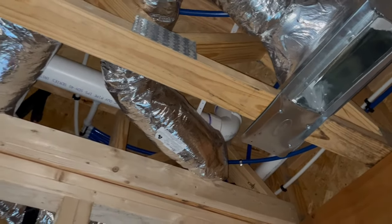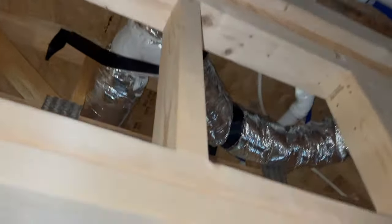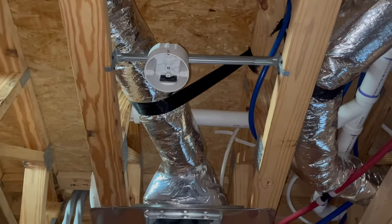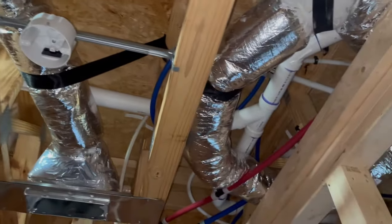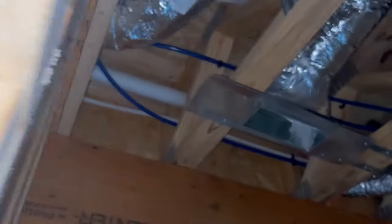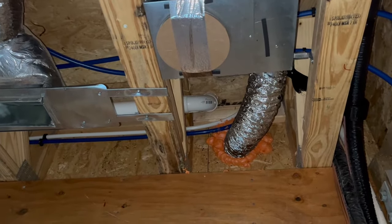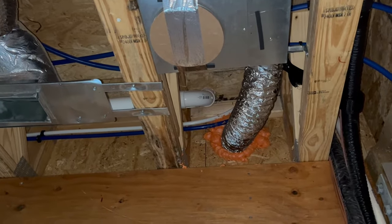All this is done for North Carolina plumbing code. That three-by-two — let me walk over here — comes out, 45 over, and then the two-inch combo goes over to a two-inch P-trap for a shower. Then out of the top of that combo it goes over and sweeps for a lavatory where everything is wet vented. That toilet and the shower is wet vented through that lavatory. If you have any questions about venting, you can go back and watch my basics of venting plumbing video — a lot of that is explained there.